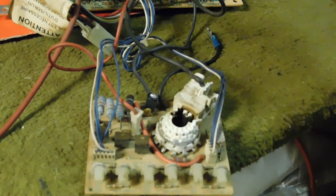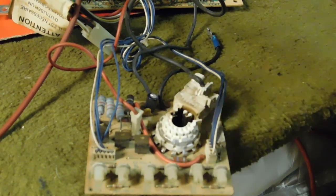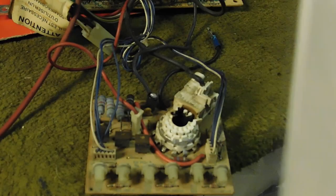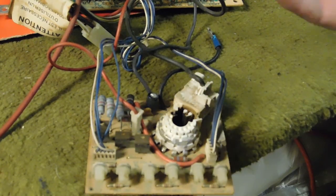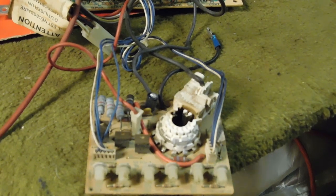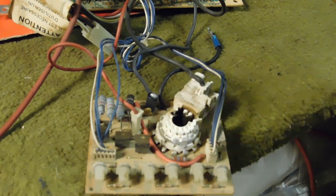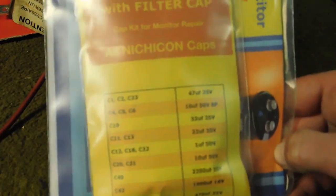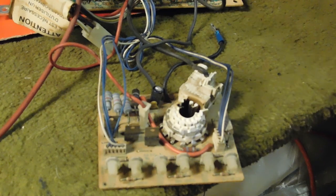We're going to remove this socket and replace it with this one. In a future video we're going to replace the flyback — I have a brand new Wells Gardner K7000 flyback. It's smaller physically than the original flyback, but most things made in modern times are going to be much smaller because of our technology advancements. I also got a capacitor kit for the chassis. I already have a horizontal output transistor in stock — it's a 1398 — so we're going to replace that as well.